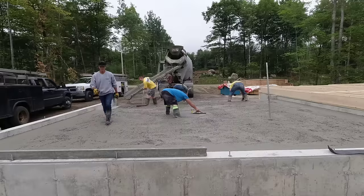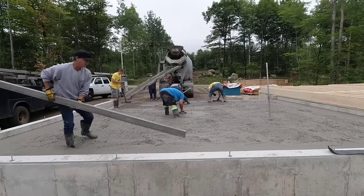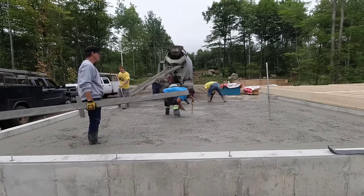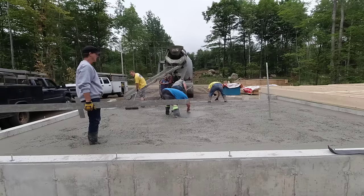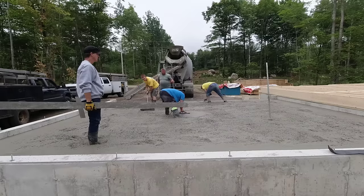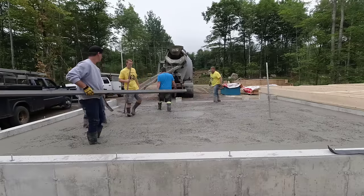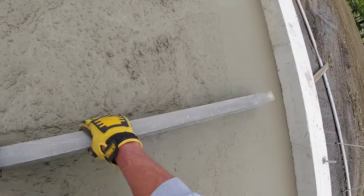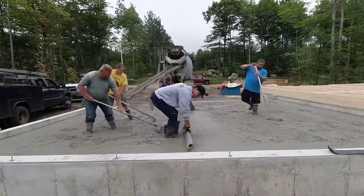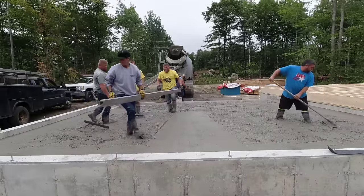So Eric's magging around the Crete Pin Pro right now, magging our center pad. We're going to get ready to screed here real quick — we're going to just hand screed this. The garage slopes two inches from the back to the front, so the back is two inches higher than the front. That's pretty much standard on most of our garage floors here in Maine — we'll slope them all out the front if they don't have some type of drain in them. What we're doing is we're striking what we call our grade pad, our wet pad, and that's what one guy is going to use to go by as we screed these bays out, and the other guy will use where they magged up against the wall.